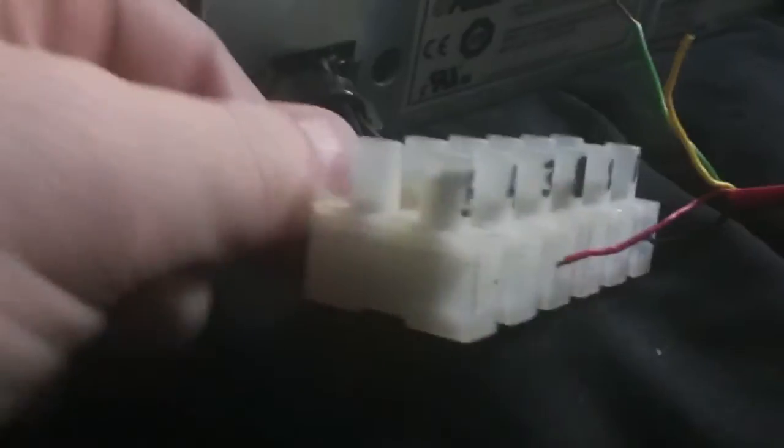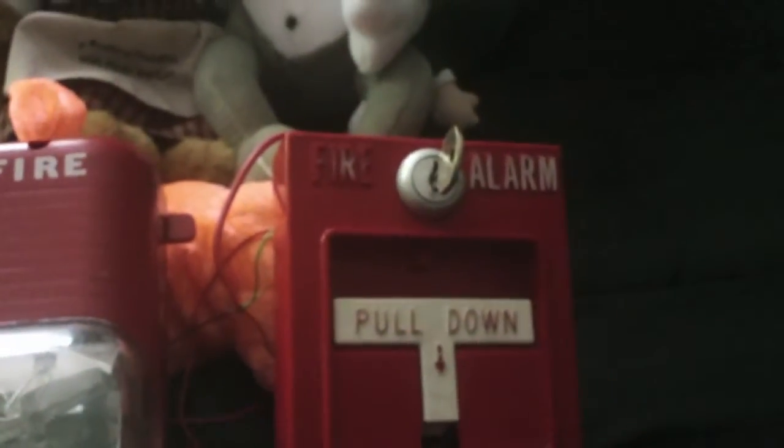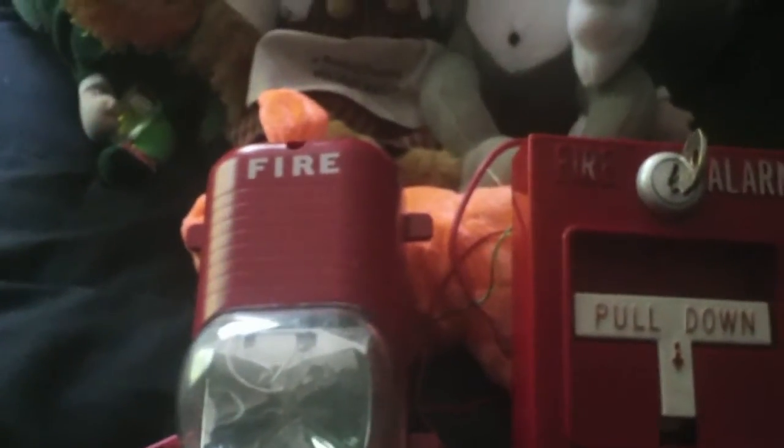So basically how I hooked this little circuit up: I had to construct this because the port right here was something I did not have a plug for, so I basically took the wires out of that port and put it into this little terminal strip here and labeled it as the positive and negative. What I did was I took the positive wire and put it into the first terminal of the Simplex 4251-20 which is right here, and the second terminal leads to the positive terminal on the back of the Spectral Alert which is right there. As for the negative wire, I just wired it directly from the power supply into the Spectral Alert. So the negative wire goes immediately into the alarm, the positive goes into the pull station on terminal one, and then the positive lead from terminal two goes into the positive on the Spectral Alert.